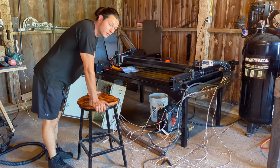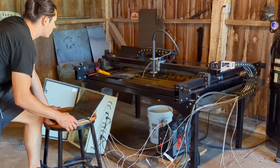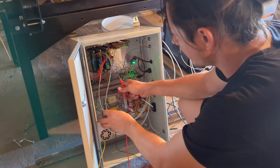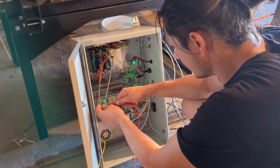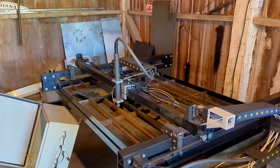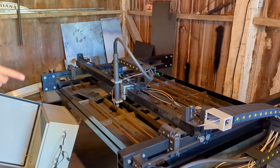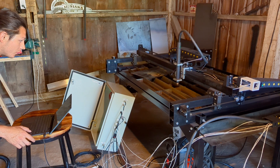I'm plugging it in for a test run. That's not good — I think I may have the wires backwards on this one. I messed up the polarity, so I just need to flip-flop these two. Left and right works. Now they're going backwards with each other — it's racking back and forth. This one is correct, this one is not, so I still need to flip them. I just needed to swap and play around with the poles on the motor a little bit.